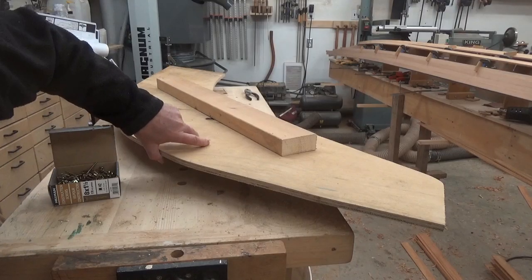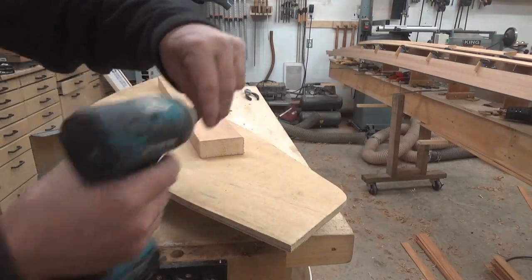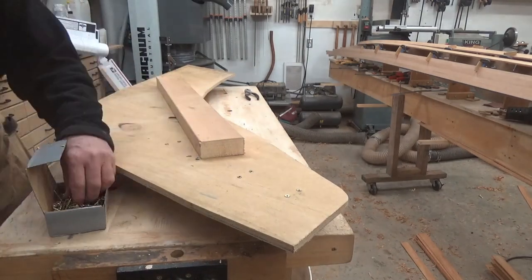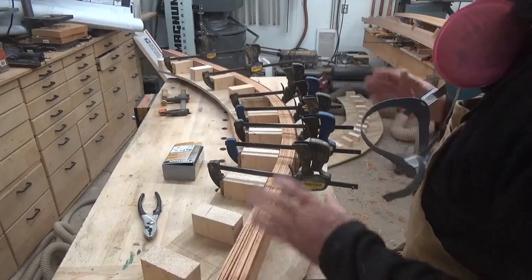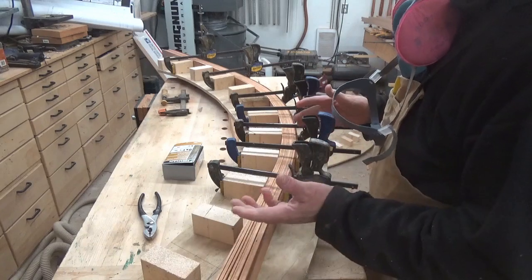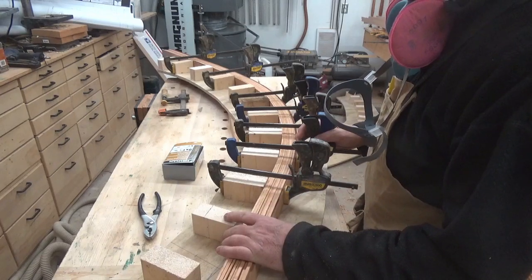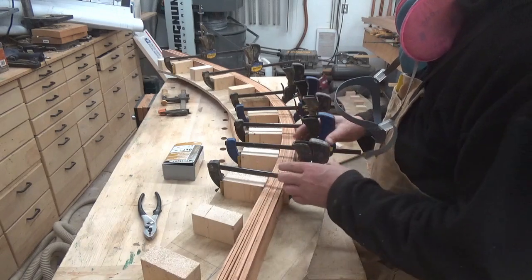Now the trick is to just drive a few screws in and hopefully I get the two-by-four blocks on the bottom secured. I've done a dry run to make sure that these laminations will actually bend around here without cracking — it seems to be going quite well, it's not that sharp a curve. So I'm ready to apply some epoxy and laminate these up, but first I need to protect my mold from anything sticking to it.